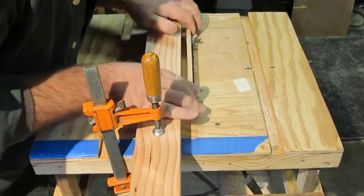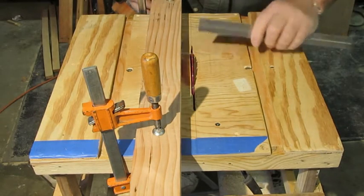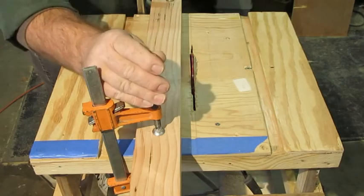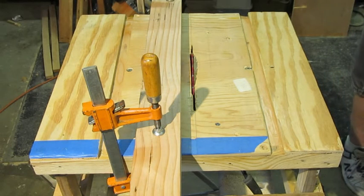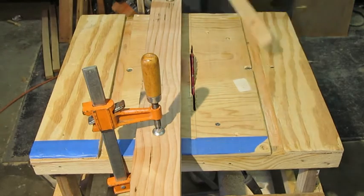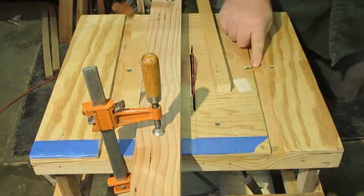Okay, so I'm set there. I'm nice and smooth, I'm not bending the blade anywhere. And of course, when I'm done, I'm going to double check that I'm at two centimeters — and I am. So now I can start making the first cut for the miter runner. I'll come over here and find my piece of stock. Just a little piece of stock here. So I'm going to cut it two centimeters wide, and then after that I'll cut it for the thickness of the table.